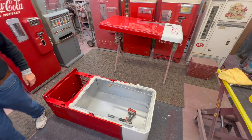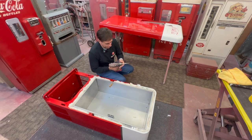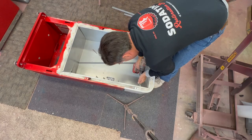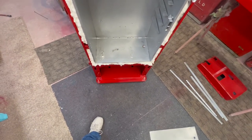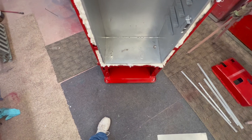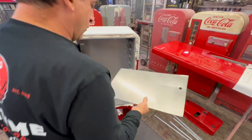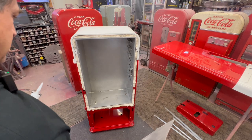There are certain screws you've got to make sure you get lined up. We'll start these on the side here — get a punch, something to help you line a few things up. You'll have a screw here on this side. We've got it standing up. If you can remember when we got this out, the base just had a lot of little pinholes in it — nothing crazy, but the base is definitely going to have a new sheet applied to it. That's what I'm getting ready to do right now. We've got our plate cut, I've got it creased the way I want it, and I have powder coated both sides. The cabinet has been powder coated and we've removed all the rust.